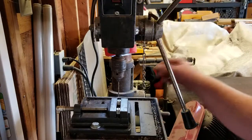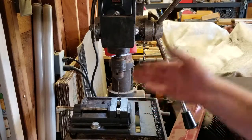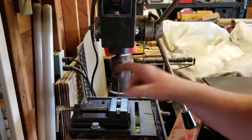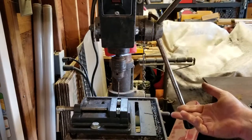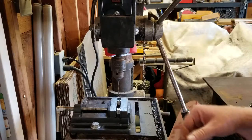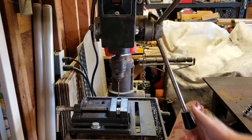The pigtail went shooting off, but hopefully you saw it coming out — that shows I was at the right speed and feed. So that pretty much covers all the tips: don't bottom out your bit, use equal clamping, use oil, and manage speed and feed. I hope those tips were helpful. If you have any questions or comments, put them down below, like and share the video, and until next time, take care.